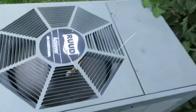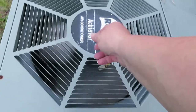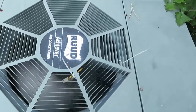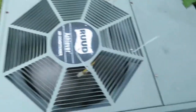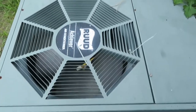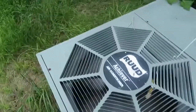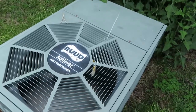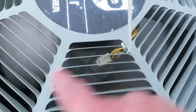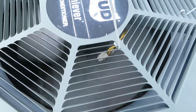Okay y'all, it is fixed! I turned the air back on. I just need to cut these tails off of my zip ties, but that fixed the issue. Thank you to my cousin Andy for telling me what to do - just replace those zip ties he had put on the AC unit. My daughter said it was cooling fine, it was just making a horrible racket outside. The horrible racket was from the wires hitting the fan blade that rotates around. We turned it off until I got home from work and could work on it.